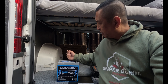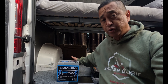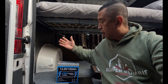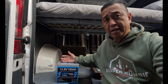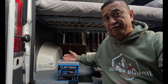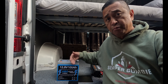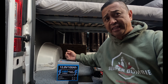Most lithium batteries now come with BMS, but the really cool thing is this is still a 100 amp discharge. Even if I have a different 12.8 100 amp hour 100 amp discharge battery, I can wire them in series or parallel. If you want to put this in your boat for a trolling motor, it's suggested for a 30 to 70 pound trolling motor. This battery is built to take a beating on the water — protection from salt water, rated IP65. Regarding cycle life: at 100% depth of discharge you get 4,000 cycles; at 80% you get 6,000 cycles; and at 60% you get 15,000 cycles.